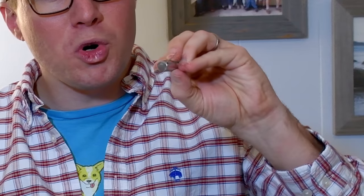Every time I go up, I always turn the clevis pin so that the cotter pin is pointing up. And then you go sailing and the stays are moving and everything's shimming around up there and whoop, it's upside down. They always want to be upside down. I've never found them right side up. They're always spun somehow. So when it turns like that, you need the legs to hold them in. So that's why the idea of bending them really far, well, now it's like super secure.